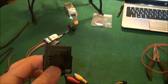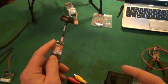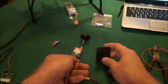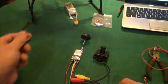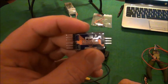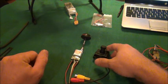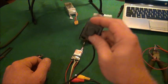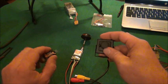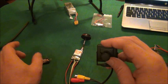The basics of what you're going to need — the OSD is always optional, you really don't need that to start. You're going to need a video transmitter — this is an Immersion 600 milliwatt video transmitter — and you're going to need a camera. Some optional things you could do once it's wired up: you can put a video switch in. This cheap one from Hobby King can control up to three different cameras, so you can switch between the FPV camera and a gimbal camera like a GoPro using an extra radio channel.